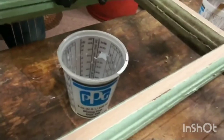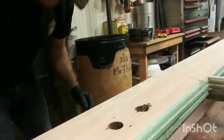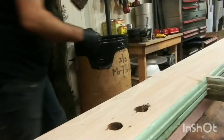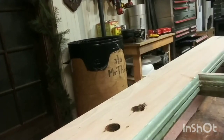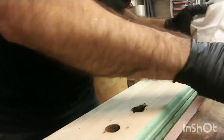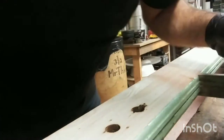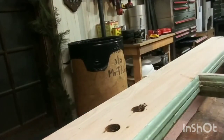It's actually the mortise that is open to the crack where the glass goes, so it won't hold any higher than that level, and it's pouring on the floor. So what I'll go ahead and do is wipe that up. And I'll have to fill that crack where the glass pane goes next time for the next pour. Lesson learned.